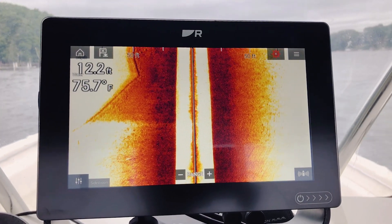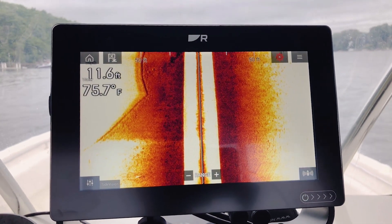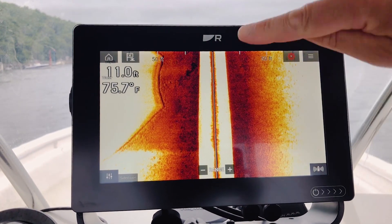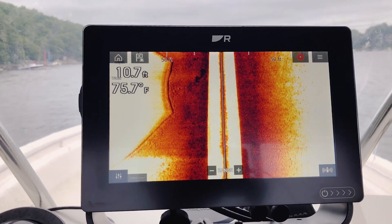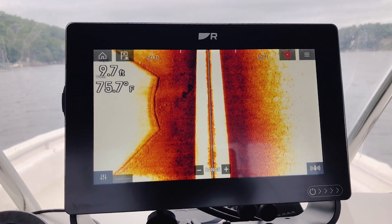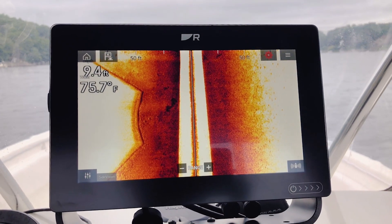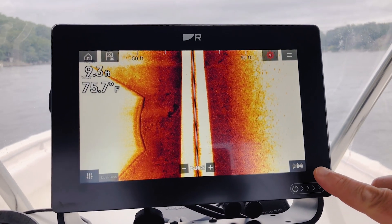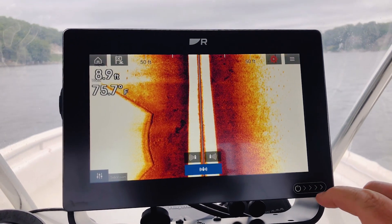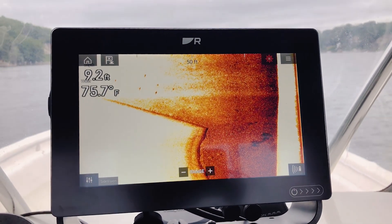This is Axiom's Chirp Side Vision channel. Side Vision sonar is used to scan horizontally through the water. Here we're actually running along a seawall — we can see it along the port side of the boat. We can see detail of what's actually on the bottom and we'll be able to see any fish holding in the water column alongside the structures. This is a high-definition sonar technology so it does a really good job of picking up man-made structures, fish, and objects on the bottom. We have some controls built into the display as well with Side Vision. Right now we're scanning to both port and starboard, but if you wanted to look just in one direction you can easily select that from the display, allowing you to see longer distances.